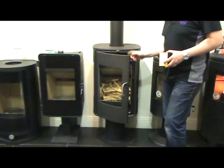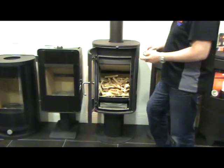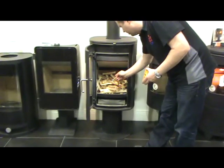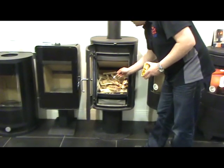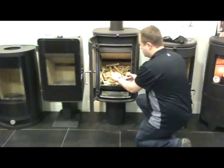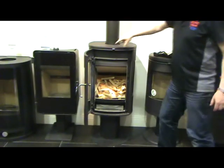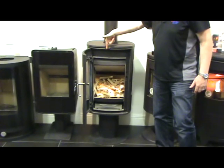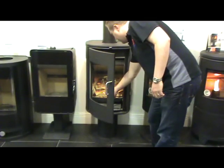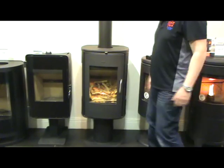What I'm going to do is just get it fired up here so we can see it burning. The 8188 is not a DEFRA approved stove, it's just a standard stove, and we generally find on non-DEFRA approved stoves we do get greater controllability. With any stove we want to have a very strong pre-fire, so I have a fire lighter down here and lots of dry kindling. I've got the air control, which is at the top of the stove, over to the right it's fully open. I'm going to leave the door slightly ajar to allow a little bit more air in and assist the draw to get the fire going.